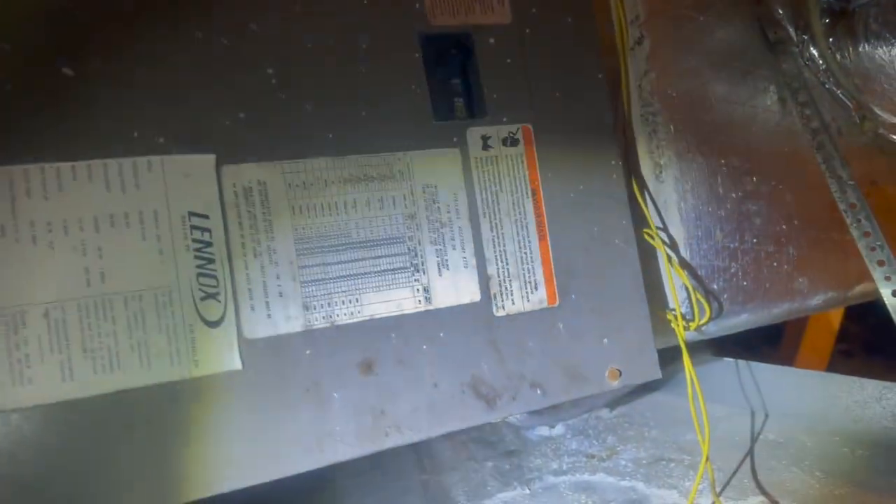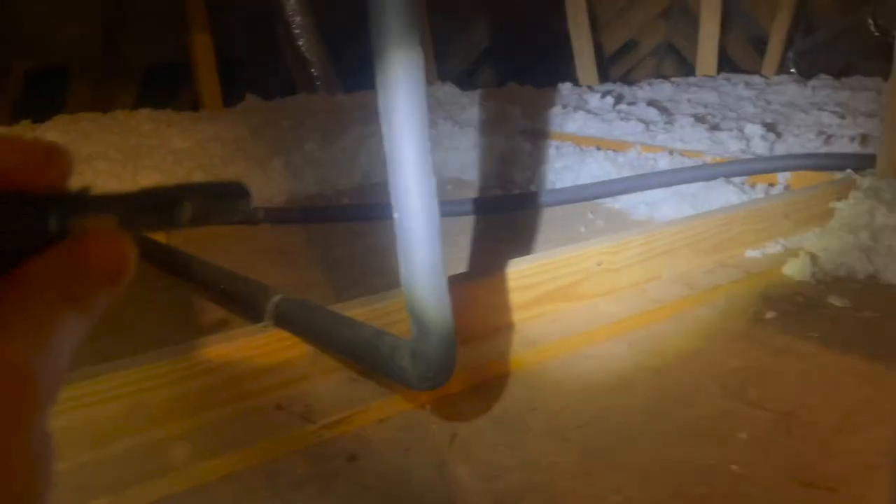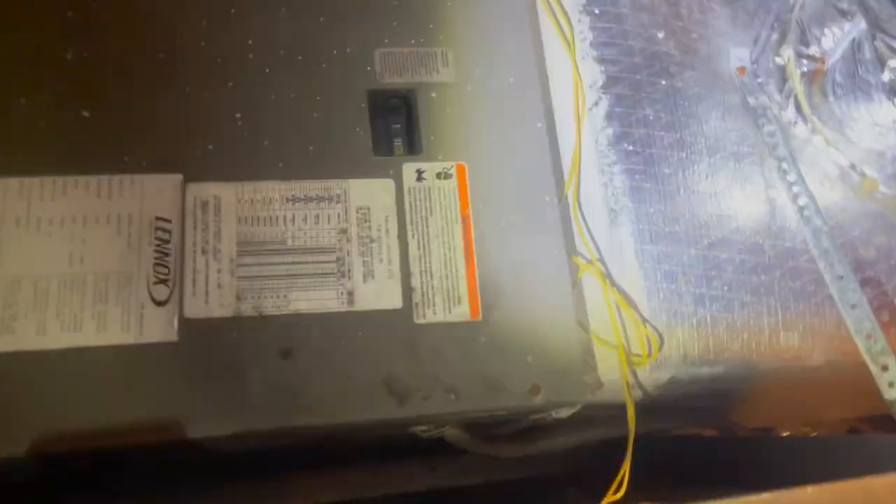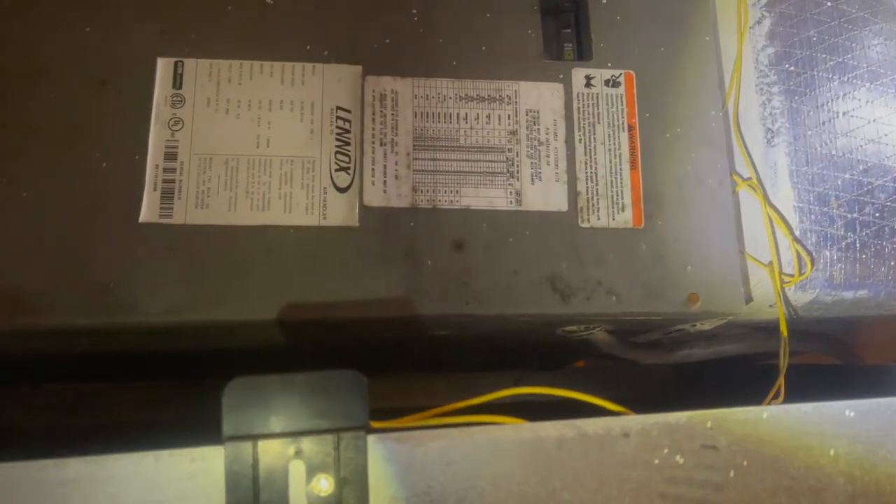I'm also going to quote her a new air handler, but it will not be hanging like this. We'll build a deck right here — take a piece of three-quarter-inch plywood on some two-by-four legs to get it above that two-by-six and set it down. We'll replace the plenums, because every time we do one of these jobs from this company, the plenums are always rusted out on the inside and you can never get them off — it leaves you nothing to screw to. So two new plenums, a deck, a new pan, a quote on just the coil, and a quote on an entire new system — I'll let the customer make the decision.